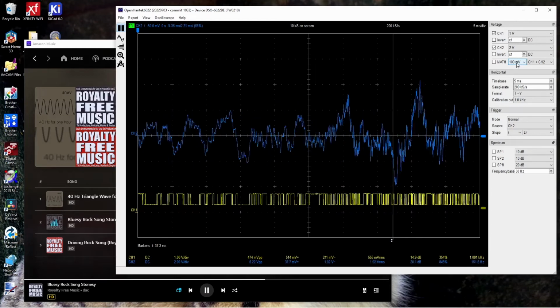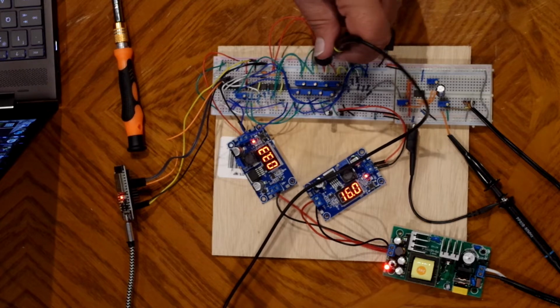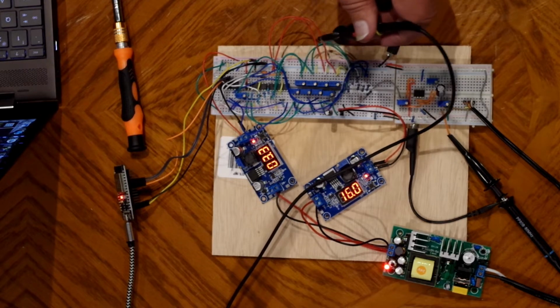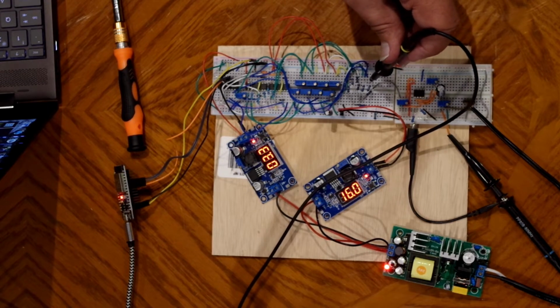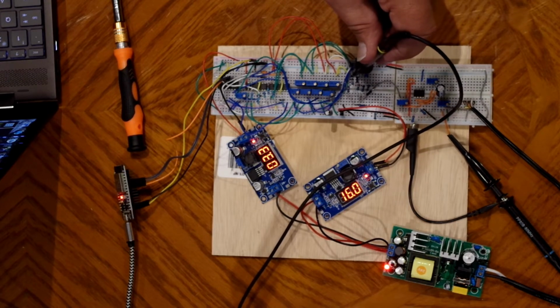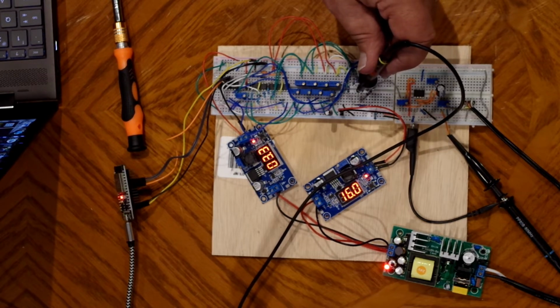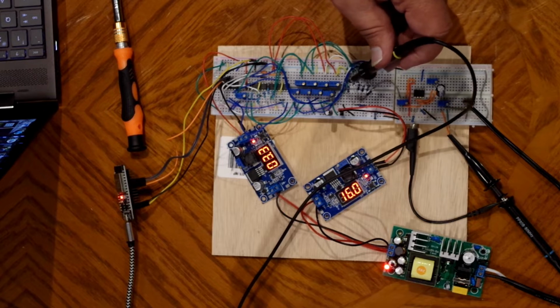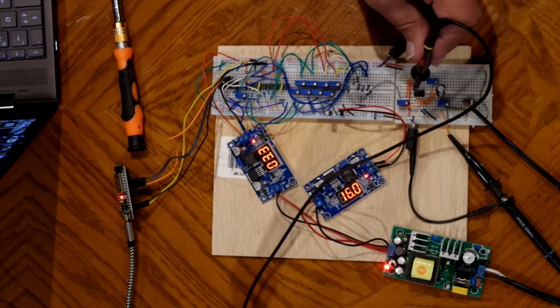That's what the voltage dividers are for. Those pots have all been tuned so that the voltage drops in half. So all those voltages come over to these resistors, and on the other side are summed up, added together, and amplified.